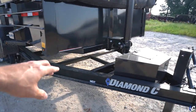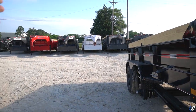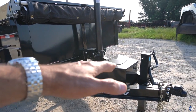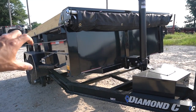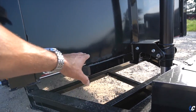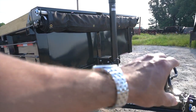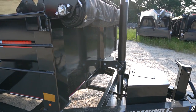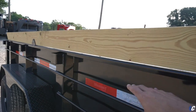The other thing to note is the six-inch I-beam frame — it's a uniframe that starts at the front and goes all the way back to the rear hinge. We borrowed that design from the LPT, the big brother that Diamond C pioneered back in 2008-2009 with the I-beam frame low-pro dump. We integrated that design into the MDT, GDT, and GST dump trailers a couple of years ago. You can see the dump frame actually sets down inside the I-beam, giving it an ultra-low deck height. There's also a little space near the cylinder where you can store chain straps and the like.